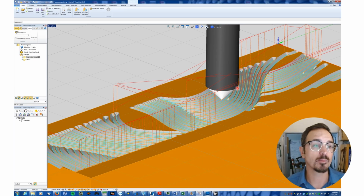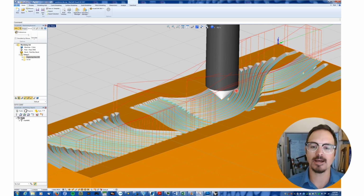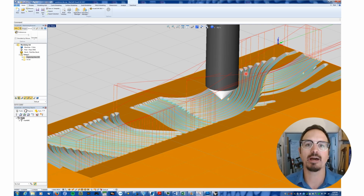Next, took it to a program called Visual Mill. This is CAM, or Computer Aided Machining. And this program takes our geometry, and then we're able to tell it what kind of tool we want to use, how we want to cut, how deep we want to cut, how fast we want to go, etc., etc. And this allows us to really control what that final piece is like. So in this case, I'm just straight engraving with a 90-degree cutter and creating these sort of series of peaks and valleys with nice sharp edges on top and under and down into the die as well.